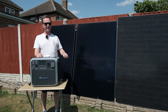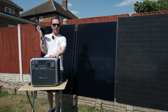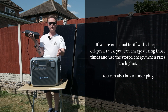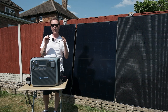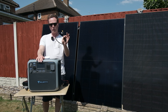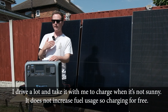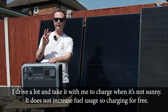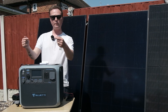The good thing about these all-in-one power stations is there are multiple ways to charge them. Here we have the solar panels. You can also use the wall plug adapter. A lot of the newer versions have a timer on the app — if you're on a dual tariff you can charge overnight to top up, especially during winter, capitalising on cheaper overnight energy. Another way is through the cigarette lighter charger, which does about 5% per hour of driving on this 2000 watt station, charging at around 100 watts. A lot of manufacturers also offer DC-to-DC chargers. Bluetti's one is called the Charger One — I bought that for about £300 and I can charge while I drive, getting to 75–80% over three hours of driving to the marina.